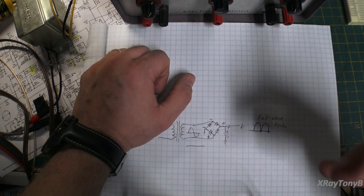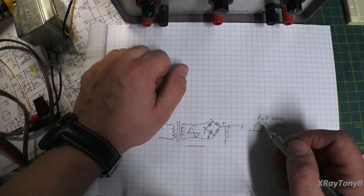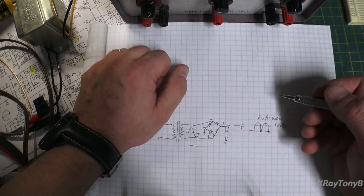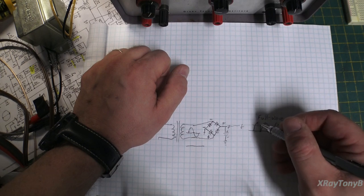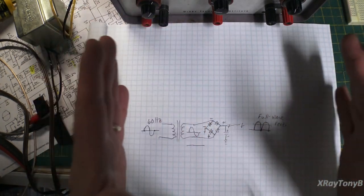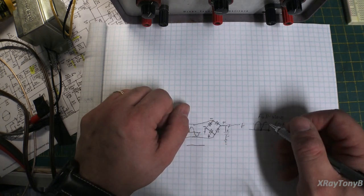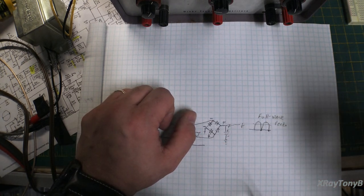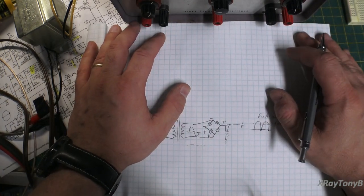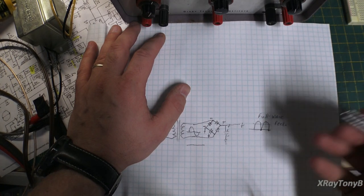So really, it doesn't give you the whole picture. It doesn't tell you what's really going on. If I hook something like this up to my radio, it's going to hum. It's going to give me a 120 cycle hum, because there's going to be 120 of these little bumps in each second. Okay? For each 1 second, there'll be 120 of these bumps, or two of these bumps for each cycle. Do you ever have an old radio, especially the old tube radios, that you turned it on and it hummed with that sound? That's what it is.